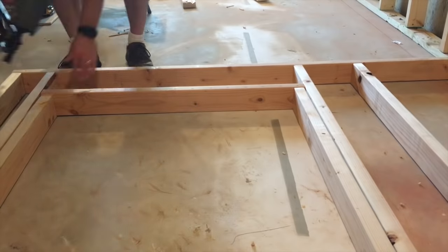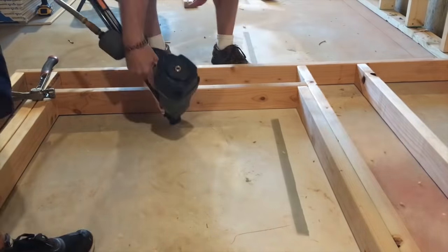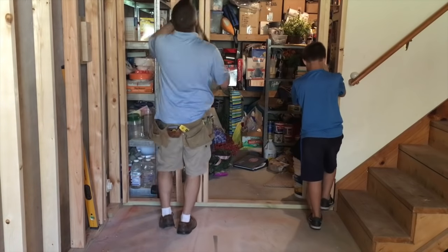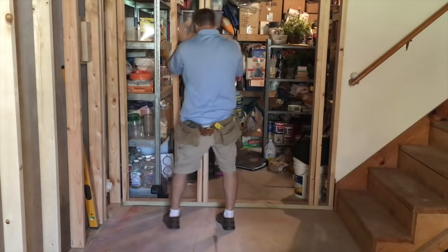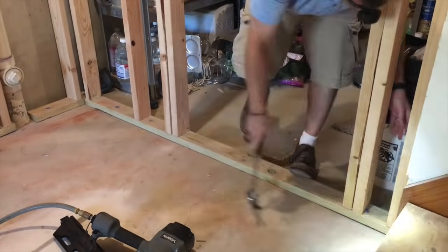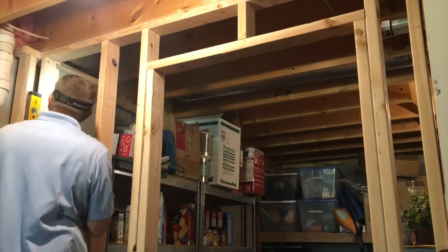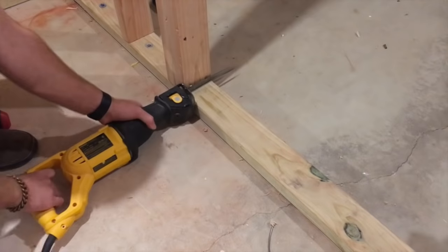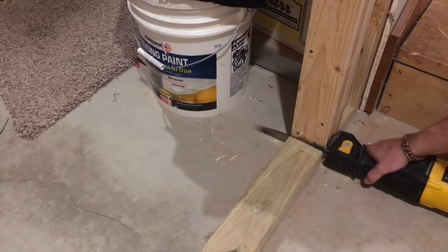Nail through to your top stud for your door frame. Add a block if necessary. Use a helper. Now hoist up your wall and put it in place. Make sure your studs are flush with the bottom plate and on the line. Toenail them in. Move to the top, level your wall, and shoot some nails in to hold it in place. If you left your bottom plate long, you can cut it out with a Sawzall. And that's it — you're done with that wall.